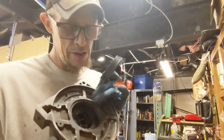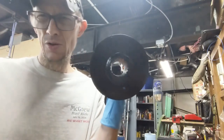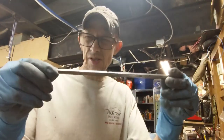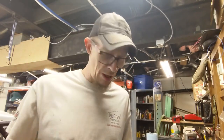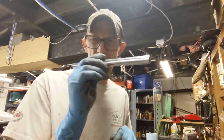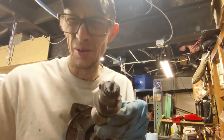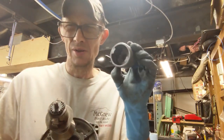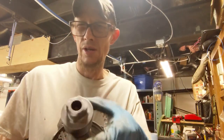The next piece is the bushing - you can see it has got this key way for it. Flange goes up. Go ahead and drop this guy in. Take your drum and drop it in there. This is the old brake drum shaft - you can see it's all damaged right here. A little bit of extra money spent - had to get a new rod. Got some more of these super heavy duty tie rods from Warn. You'll see this is how this assembles - it's going to be under the drum so you won't really be able to see it. You can see how these keyways go on here. These two gears need to go like this: keyway at noon and six, so these will go at nine and three. That way that brake will work.